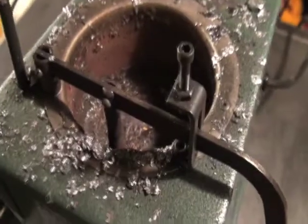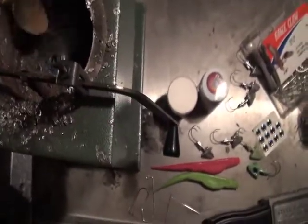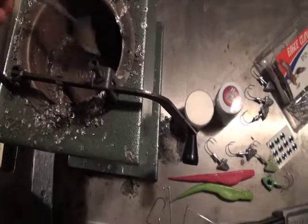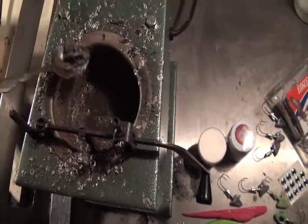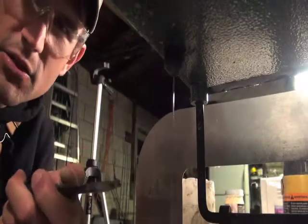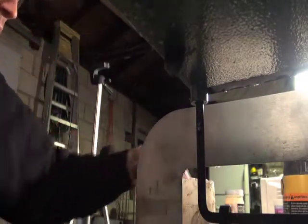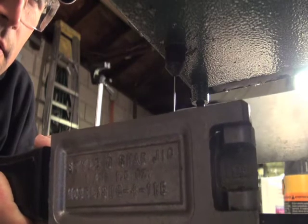There's also a fluxing agent that you can add to your lead, and you're going to just sacrifice an old spoon. You're going to be skimming out a lot of those materials so that you have nice clean lead to work with. You do have some stuff that oxidizes, and you'll have some impurities that you'll want to skim out from time to time. Yeah, see how nice it's shooting now? Straight out. Much better. Alright, got my hooks in there. Go ahead and one ounce.